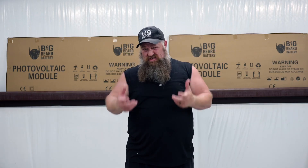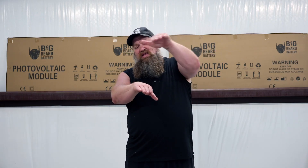The solar controller takes that high voltage, steps it down to battery voltage, and then produces a current. But if the panels were in parallel, it may be 20 to 30 minutes later in the day before you really start charging, and then it's going to stop 20 to 30 minutes earlier.